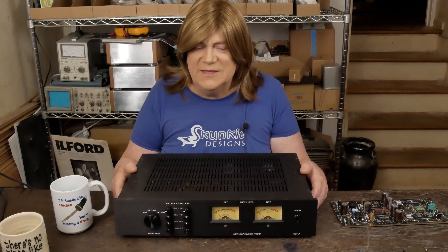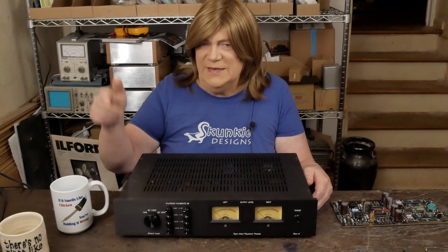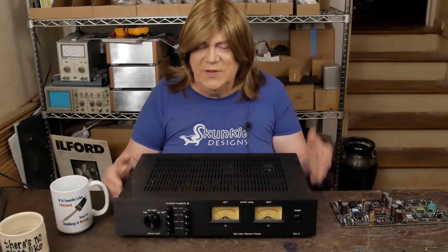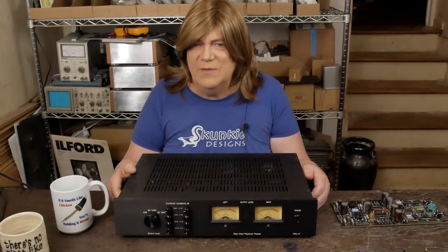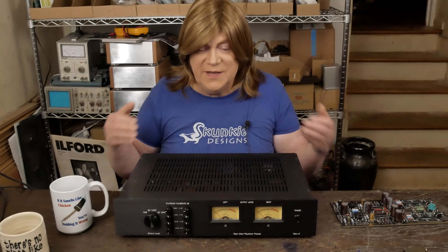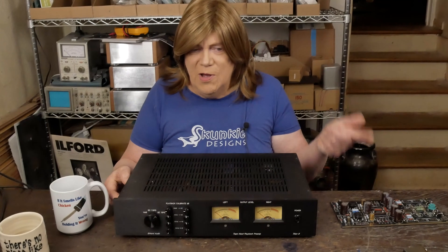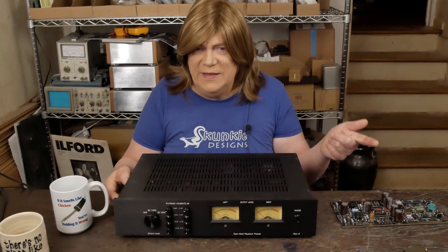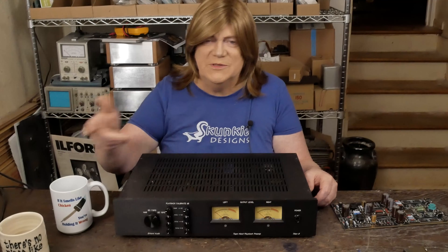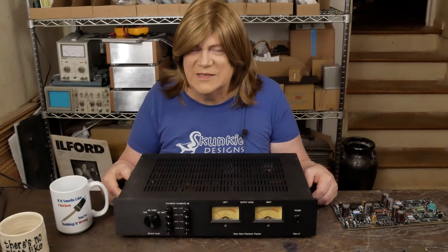The next video I'll show you how to modify the TASCAM 32 to do the tape head out — it's easier than you think. There are only a couple of little things you probably got to tune up on the deck. Go ahead and buy a new belt; it just has one belt, and while you're in there you might as well put a new belt in it. And then you're basically bypassing all the internal electronics. So as long as the motor runs right, it's the right speed, the push button controls work — it starts and stops — and the heads move back and forth like they're supposed to into the tape path.